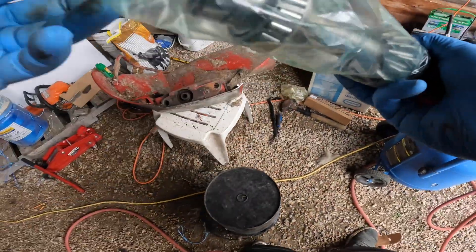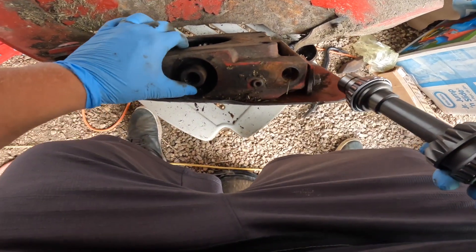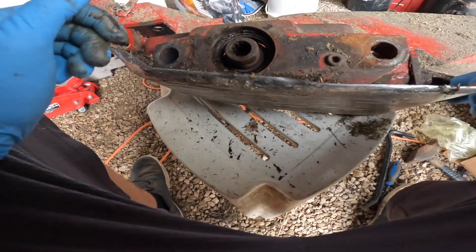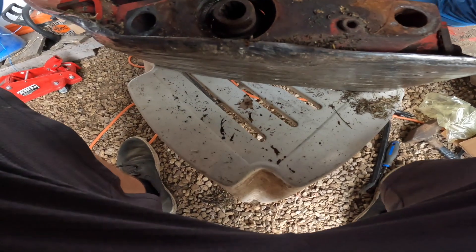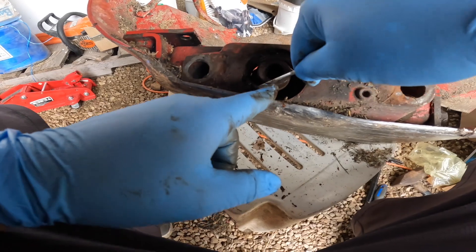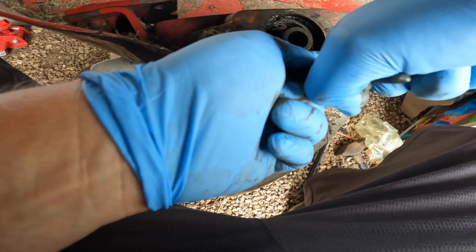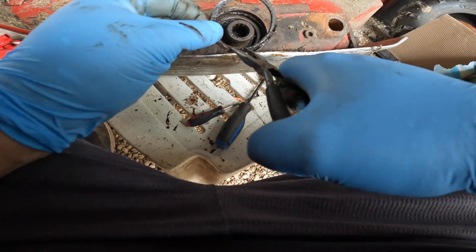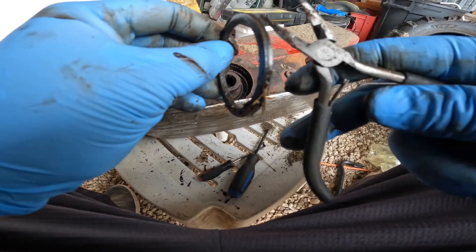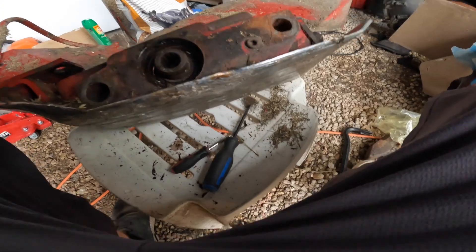This main part is going to be going in here because this one is toast — bearings are toast, stripped. Got a snap ring here. I popped off this cover — just took a chisel and popped her off — and we've got a little collar, a little clip here. These collars are always fun to get out. It's just a little snap collar. They've got a couple of collars, yeah. I remember seeing a bunch of collars in that pack.